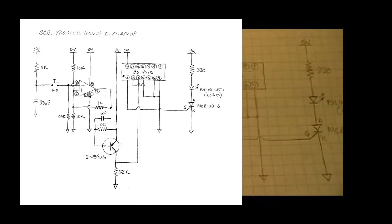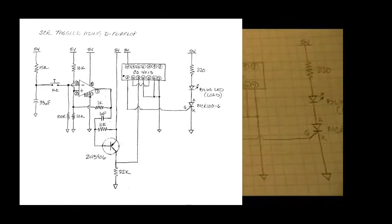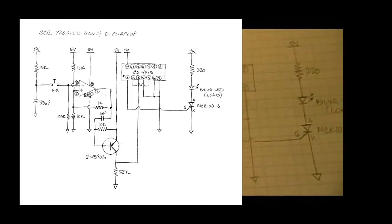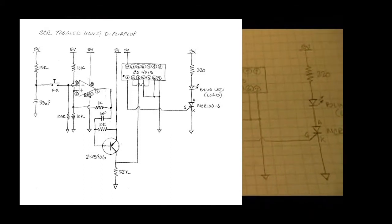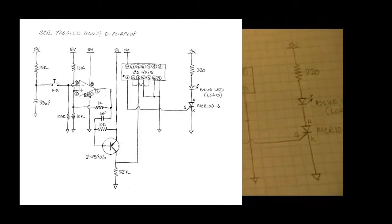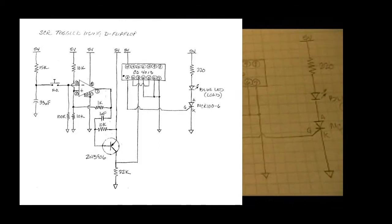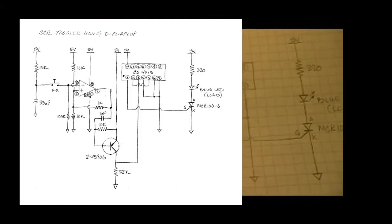So it bounces the trigger point back and forth to each extreme, so a little bit of a variation on the non-inverting input is not enough. It has to significantly rise or significantly fall to change the comparator. Then we take the output off of that comparator through a 1 microfarad capacitor, in this case a decoupling capacitor. It has to be there. Without it, you potentially end up with another 10k ohm resistor off your output going to 5 volts, and you end up with a very odd thing, and I guarantee you your Schmitt trigger will not work properly. So you must have that decoupling capacitor. In this case, 1 microfarad worked very well.